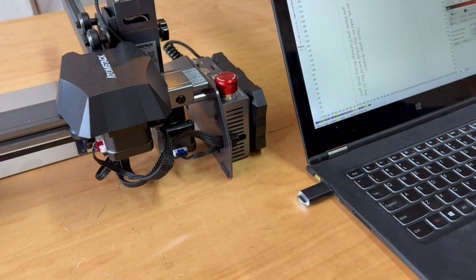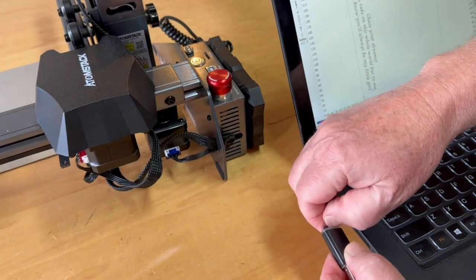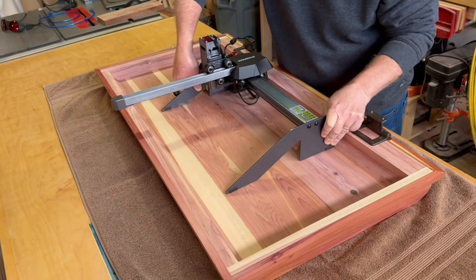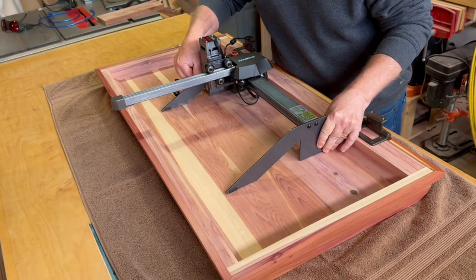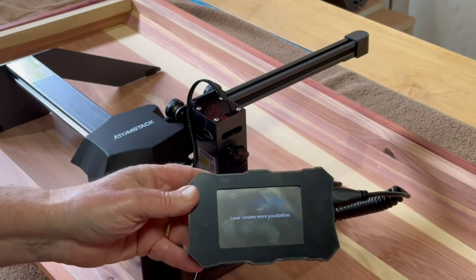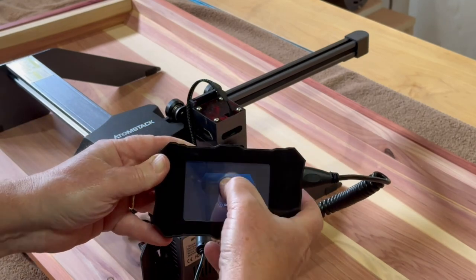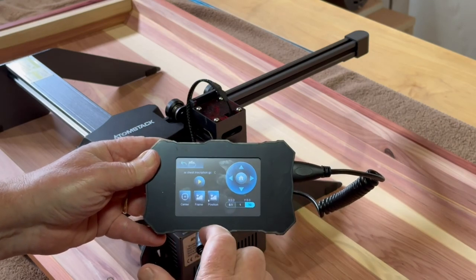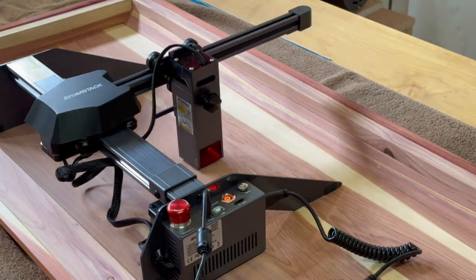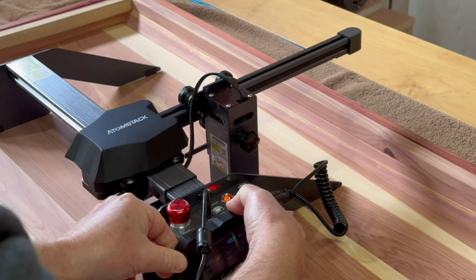It's going to be less convenient to have my computer connected, so I'll make use of the offline engraving capability by saving the g-code from Lightburn onto the TF card and then placing the TF card in the laser. The small footprint of this laser is really nice since the inside of the cedar chest lid is recessed — it might be a hassle with a larger non-portable laser. The touch screen control is great; you can lift and hold the touch pad in your hands at any height or angle that feels comfortable, and the controls are pretty intuitive. I select the file from the TF card, use the frame feature to double-check the laser is positioned correctly, then push start. The touch pad is held onto the frame with magnets when you're not using it.